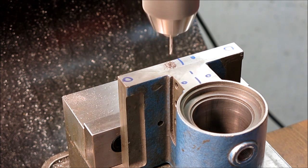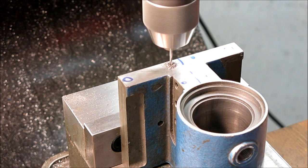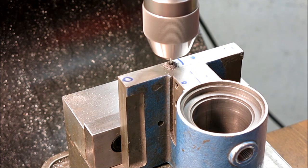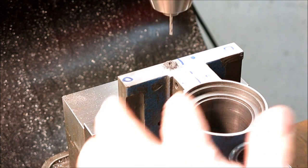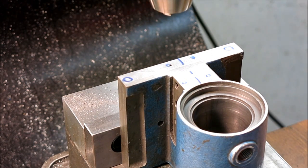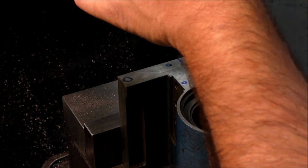And it's 300 deep. I think I'll just go a half inch, something like that. 400. All right, here's a half inch, which is plenty deep. If you have a choice, it's better to over drill a bit and give room for chips and all that down below.